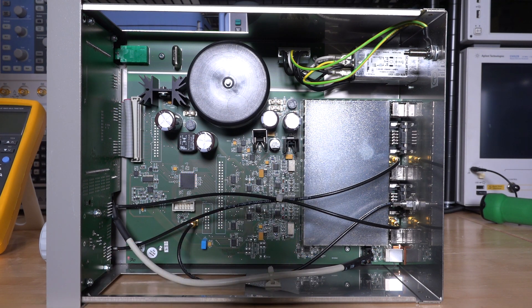I want to remove the case to take a closer look. The contrast problem has nothing to do with any of the analog stuff, but I did notice something interesting: when we turn it on, the screen is initially a little bit brighter, then we hear a couple of beeps and it dims down. So the power supply seems to be being dragged down, which is not a good thing.